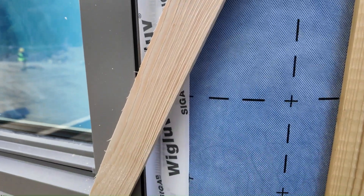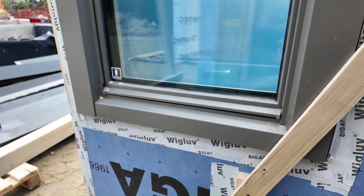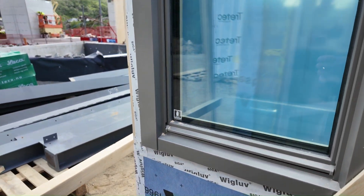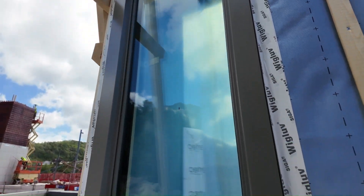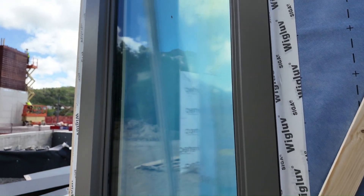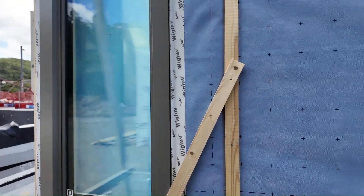If we take a walk inside the frame here, you can see they're basically taped on all four sides. So it's not a water-managed system — this is a total water barrier system, taped on all four sides. Those are the Nordan triple-glazed windows; we actually just drove by the factory to get here.